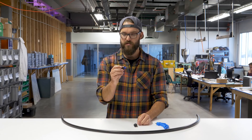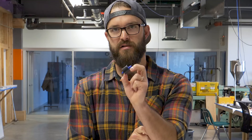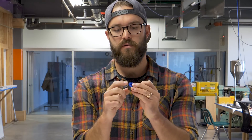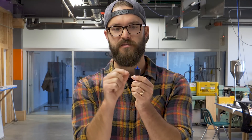We've also used these clog-free drip emitters — a little different design. They're just a solid piece, so nothing comes apart. The one thing with these is that you have to have a pressure of at least 15 PSI for this particular one for it to operate as intended. The way it works: there are a couple of vertical rubber sheets with a series of holes in them, and if one of those holes gets plugged, pressure builds up behind the plug, the rubber gasket expands, allows the particle to pass through, and then you're back operating again. That's the clog-free function, and we've been really happy with these.